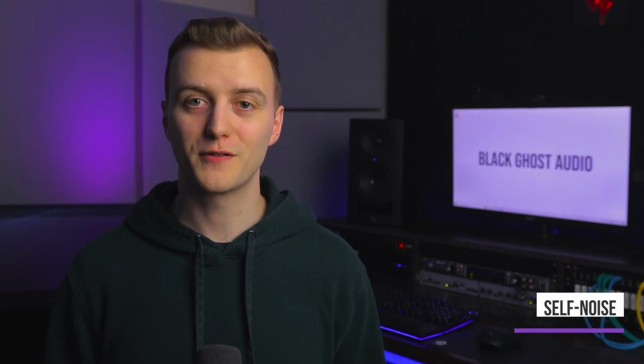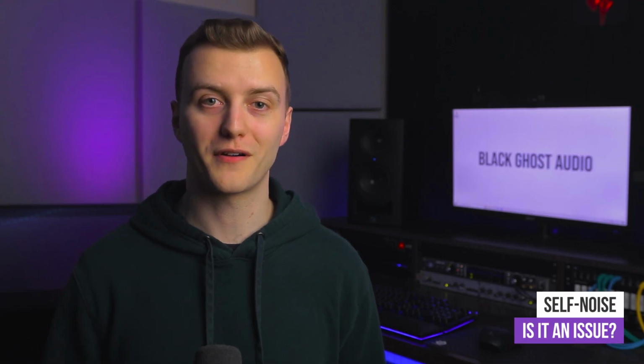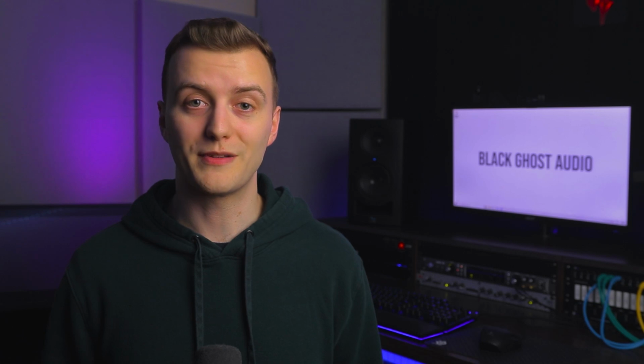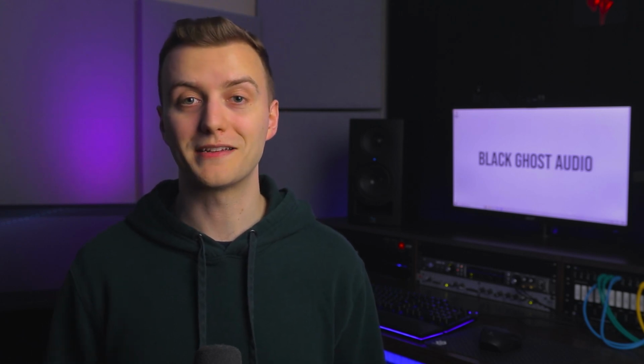All studio monitors produce some level of noise when they're turned on and just sitting there. Electronic components produce noise naturally, and since studio monitors produce sound, you're able to hear this noise. Ideally, you want the self-noise level of studio monitors to be as low as possible. The higher the noise floor, the harder it is to hear the quiet details in your mixes.